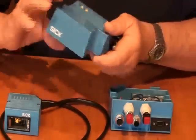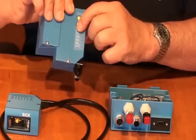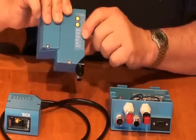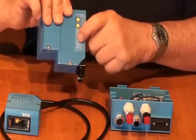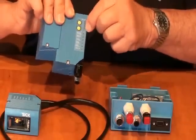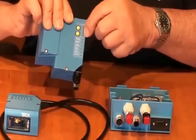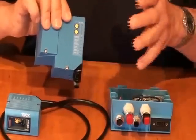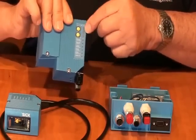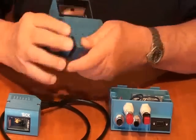There's one more thing I forgot to mention. We also have push buttons, and those push buttons are very useful for setup. We can energize a diagnostic mode, we can trigger the scanner, we can change a few functions with those buttons. You can see there's a light scale here — LEDs that give you indication of the read quality. Each LED indicates a different percentage, from 10% up to 100% read rates on the scanner. Without even hooking a computer up, you can see exactly how the scanner is doing by looking at the LEDs.